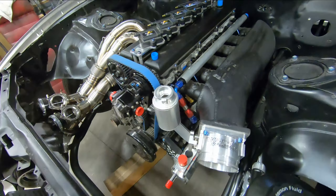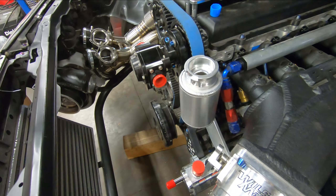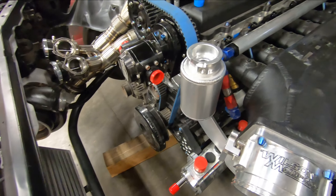We need to cope the piece of tubing to fit the outside radius of the fill pot body. Once the radius is coped, I can cut the tube down to size, weld the number 16 fitting onto it, then mark out, cut a hole, and weld that onto the fill pot body itself.